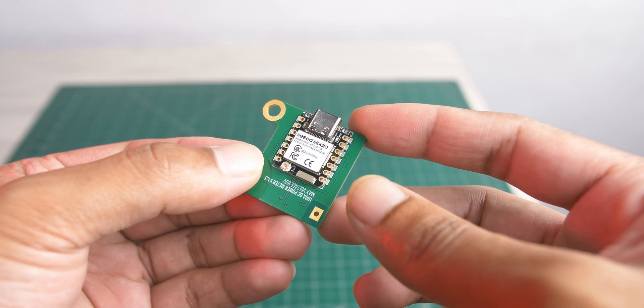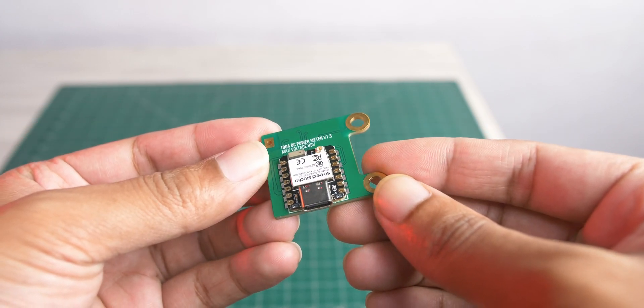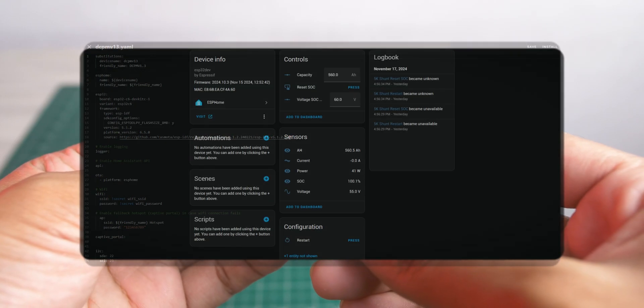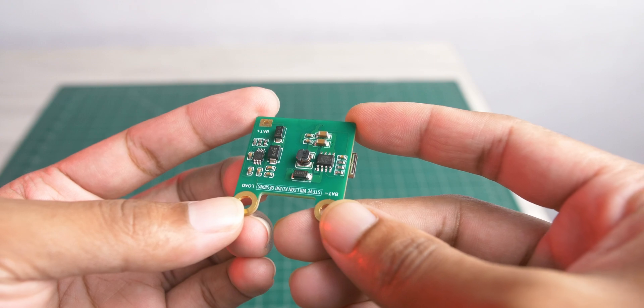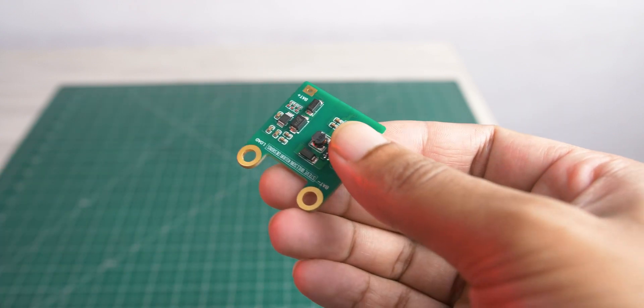This module can measure DC current up to 300A and voltage up to 80V DC. The firmware is built using ESPHome and tightly integrated with Home Assistant. The problem I was facing with the JK BMS is drift of SOC and unstable current and power monitoring.